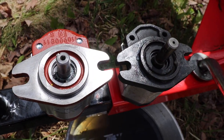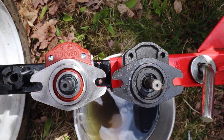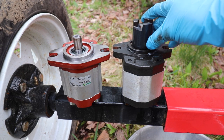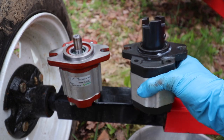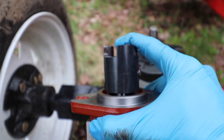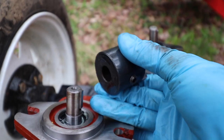Here are the two pumps side by side — the new one on the left is just a little bit bigger than the stock pump on the right. The other noticeable difference is the shaft on the new pump: it's a little bit shorter and the ridge on the bottom sticks up a little bit higher, and this caused a problem when I tried to put the coupler on. On the old pump the coupler slides down and sits flush with no gap. When you put the coupler on the new pump, that ridge prevents the coupler from going all the way down, leaving a gap. When I test-fit it against the backhoe, it made the whole pump stick out — it wasn't sitting flush with the machine.